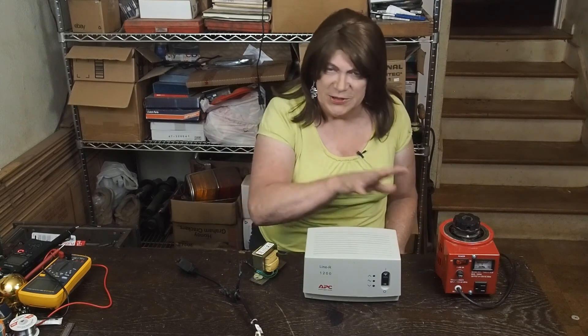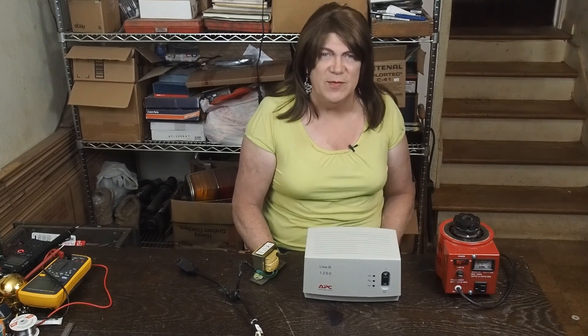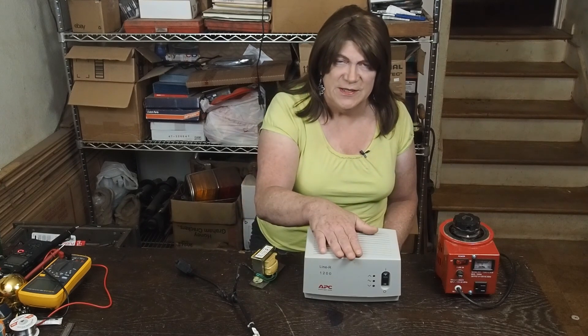If you don't get the voltage back down to 110 and keep running at 120 volts, it's going to burn up tubes, could smoke, catch on fire — who knows. It wasn't designed for that. Tube amplifiers are very different from solid state when it comes to operating at voltages they weren't designed for. I know some Chinese websites and Amazon ads claim they'll operate on anything from 110 to 120 volts — that's just not possible, that's a marketing lie. So either get a bucking transformer and wire it up, or get one of those APC boxes.